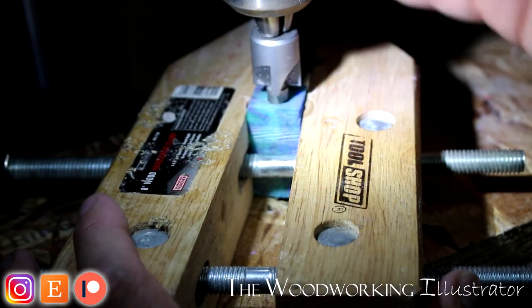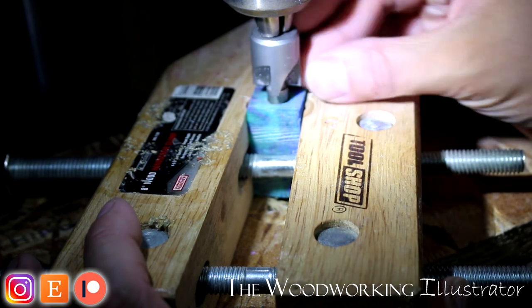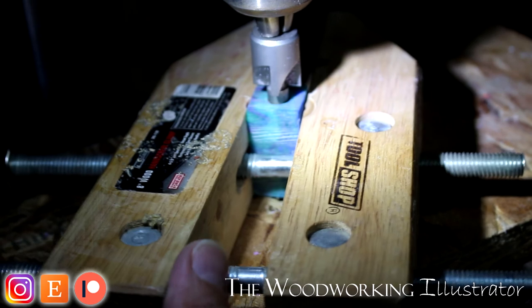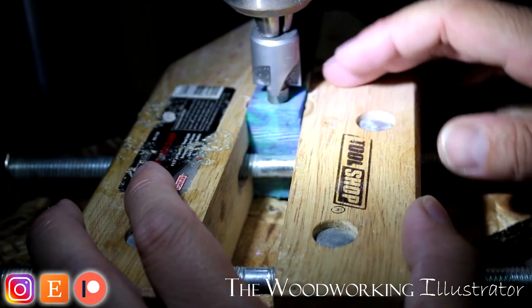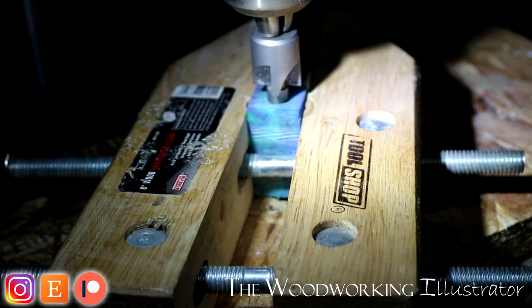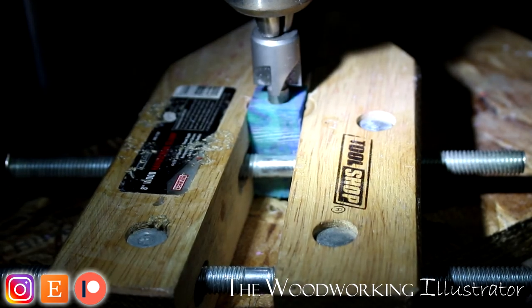Alright, so I let the glue set, and now I'm ready to use my barrel trimmer here to flush up the blank ends. You always want to just stop once you see the beginning of the barrel. It just helps to make it all flush so that when you put the pen parts in, everything will be even.